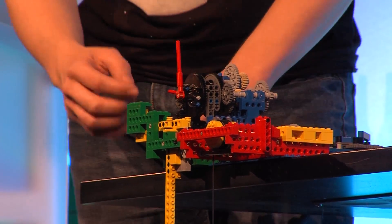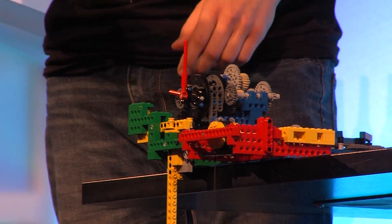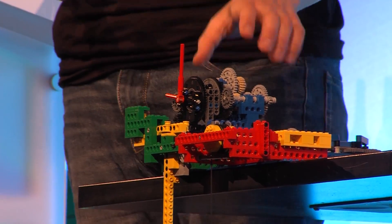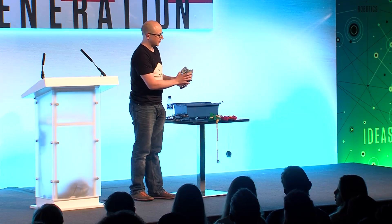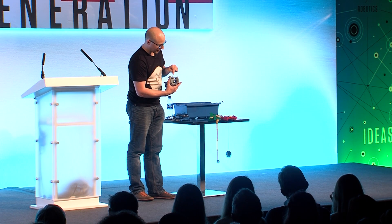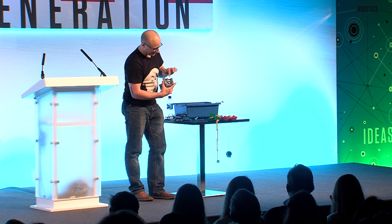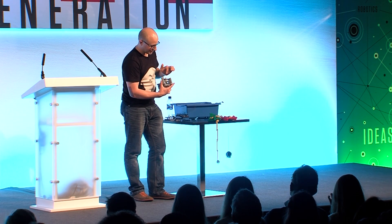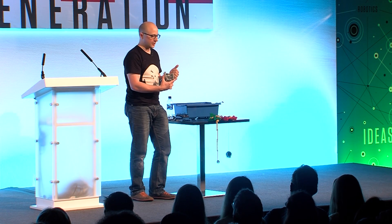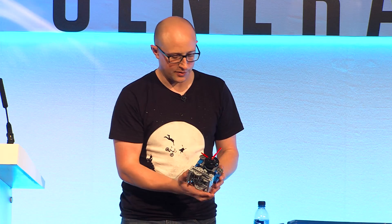To do 60 ticks in a minute, we need this to move by one-sixtieth every second. So we need to divide one-eighth to get one over 60, and 60 over 8 is 7.5. All these gears are doing is dividing by 7.5: we've got 8 and 40, that's dividing by 5; then 8 and 24, that's dividing by 3 — so that's 5 times 3, a total division of 15. Then we increase that by 2, so we multiply by 2, which gives us 7.5. So now the clock is going to drive the seconds correctly.